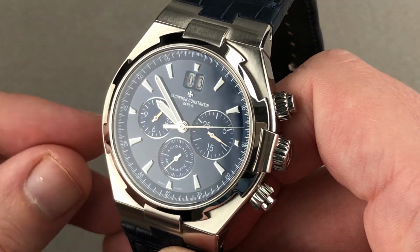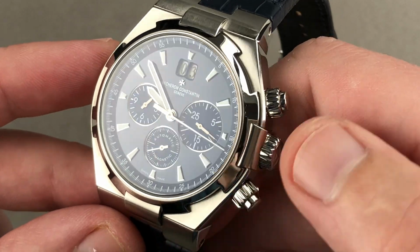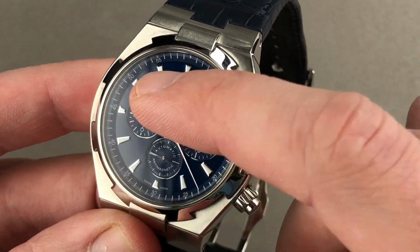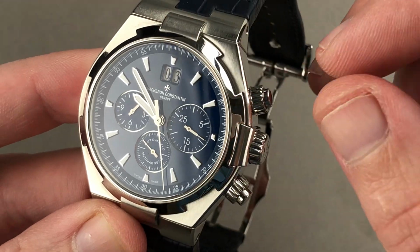It is an integrated, thus purpose-built automatic chronograph caliber with both vertical clutch and column wheel. The column wheel making the function selection crisp, the vertical clutch allowing you to run the chrono full-time if you want and start the chrono without any jump to the seconds hand.